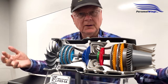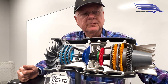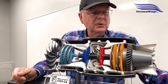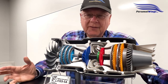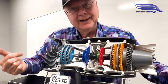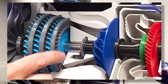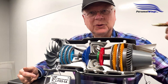So imagine you're a pilot in the plane. On this engine, you turn the switch in the Cirrus Vision Jet to run and press your start/stop button. What happens is a starter generator — which is a starter when starting and turns into a generator once the engine is started — drives through this tower shaft and starts the spinning of the N2 section.